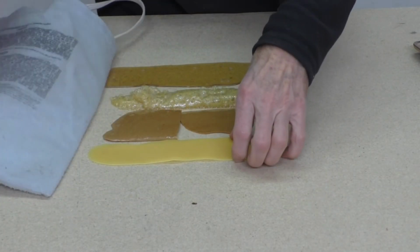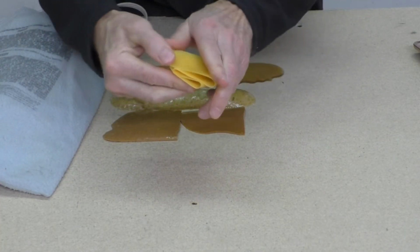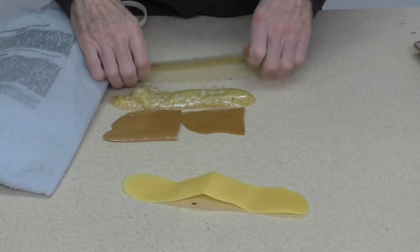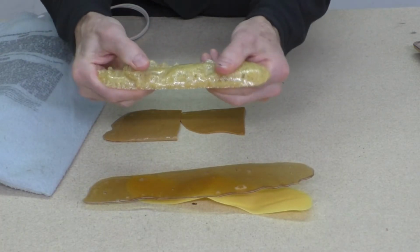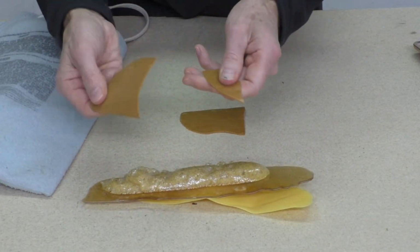Look at this PVA glue. It's just about as soft and flexible as the contact cement was. Here's the epoxy, no difference. The polyurethane, same. And the urea resin, still rock rigid. So now let's look at this same test except with moisture.